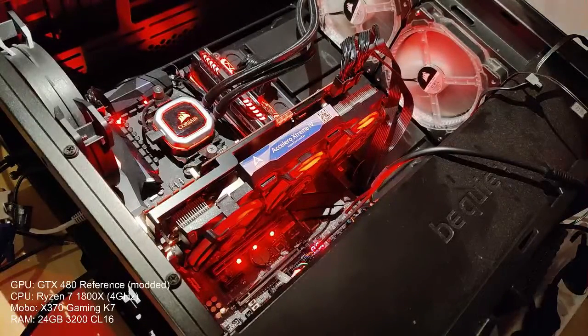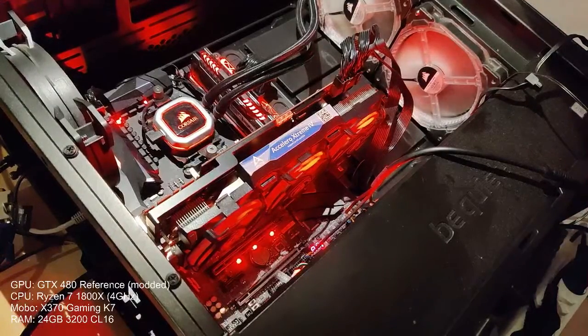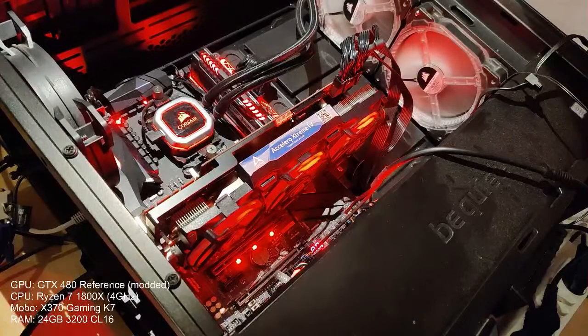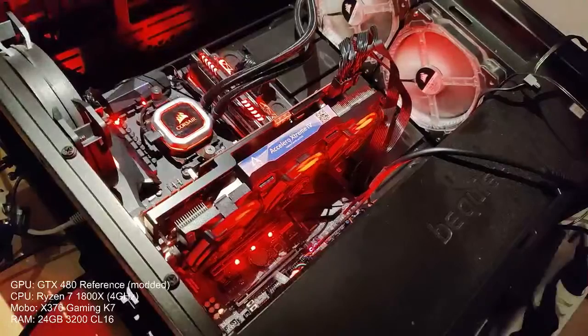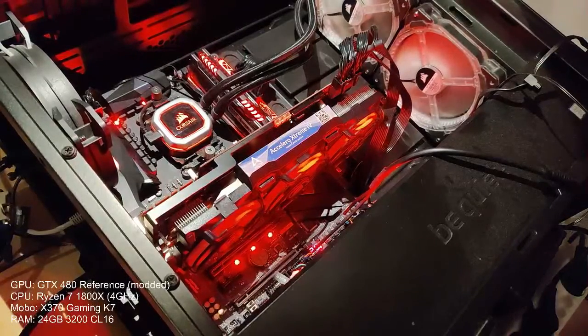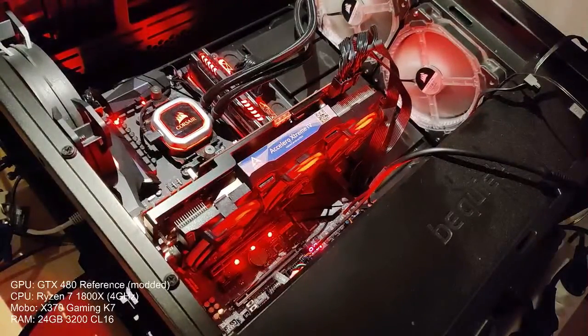Okay, so it's gonna take a while because we just put in a new card, or actually, yeah, it's doing what I was afraid it would do. No video. So press reset. Sometimes pressing reset once just helps. But yeah, 580s in general are just really a pain to get working. Yeah, it still doesn't work.